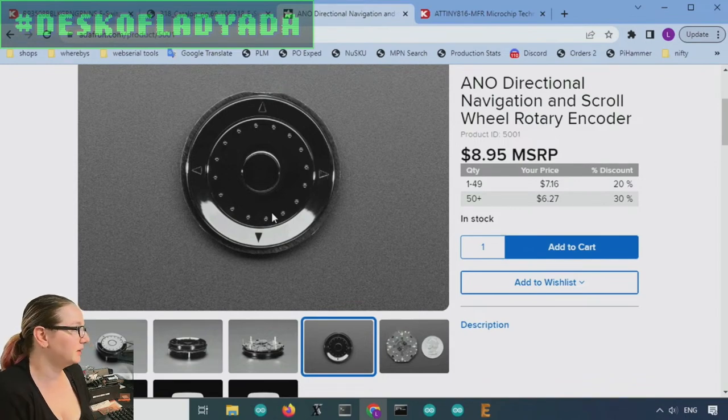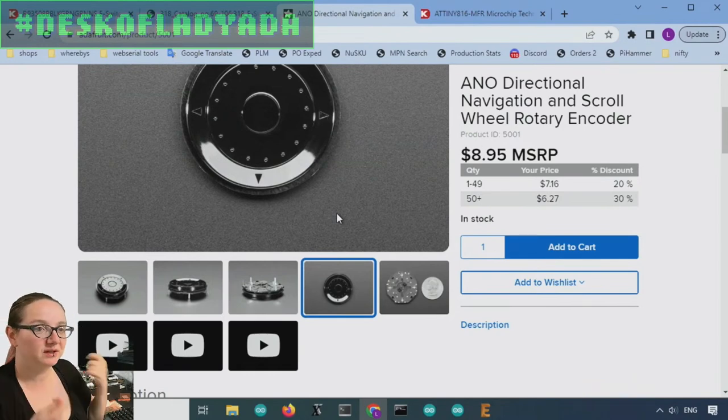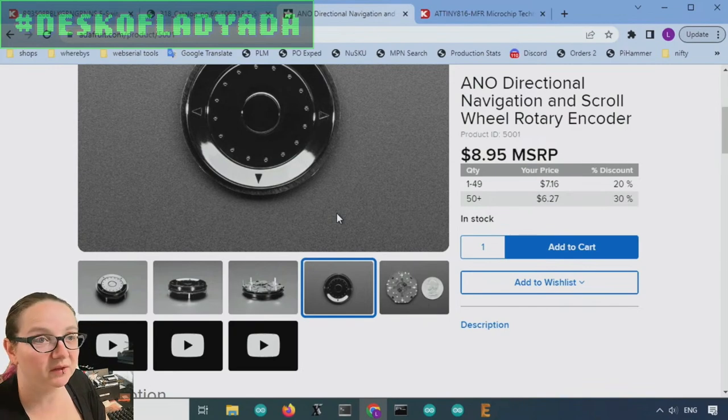Really fun and tactile, but you need a ton of GPIOs to use this because you need 2 GPIOs for the rotary encoder, and then you need 5 GPIOs for the switches. And you also have to constantly be checking them and doing interrupt stuff. So I thought this would be a great candidate for rotary encoder support. So this is the prototype. Let's go to the overhead.